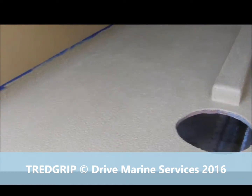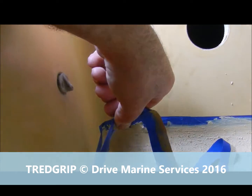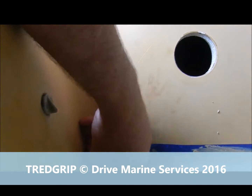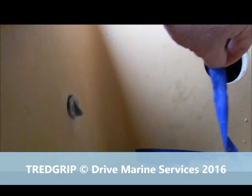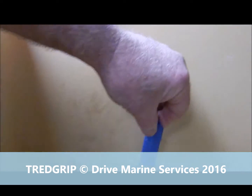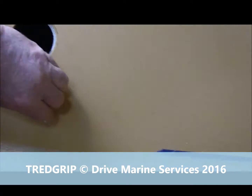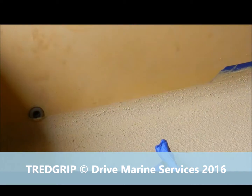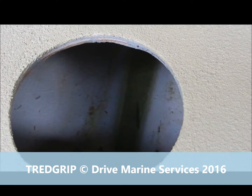We've now got three coats of tread grip on our deck and I've started pulling the tape off — fairly easy to pull off. If it's not going furry, just pull up like so, pull it away from it and it'll give a clean, nice clean edge. If you pull down or just pull straight out it'll tend to go furry. Notice how there's been two or three different levels of masking tape put on — the reason being so we could keep it flat. Just pull them up, and see how we've got a nice clean edge. It looks a million dollars compared to what it looked before. That's our deck completed. Next thing we're going to put some bungs back — some portholes, manholes — and away we go.